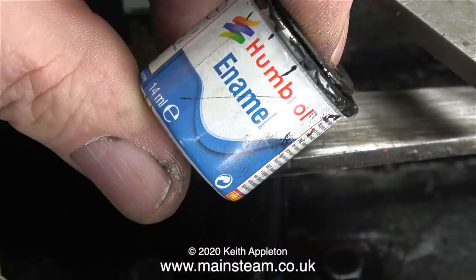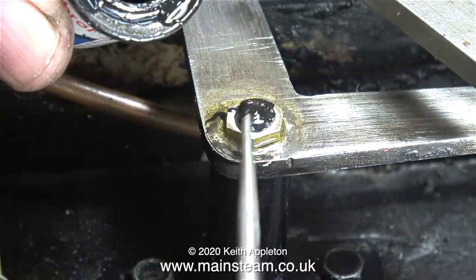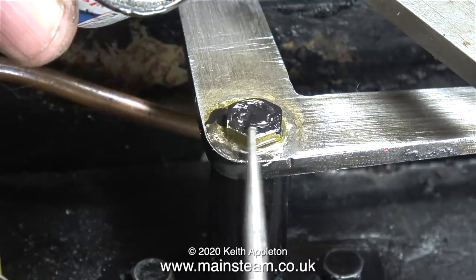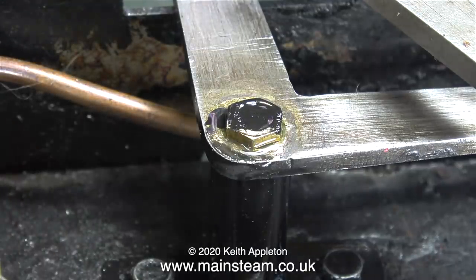This is a good way of retaining nuts and bolts: put some paint on them. I don't really need to do this — it's just a good tip. I used to work on a lot of electronic equipment at one time, and I noticed that often the threads of retaining bolts had just got a blob of paint on them, so I'm replicating that for old times' sake. Look at this clip carefully — the paint is self-leveling.